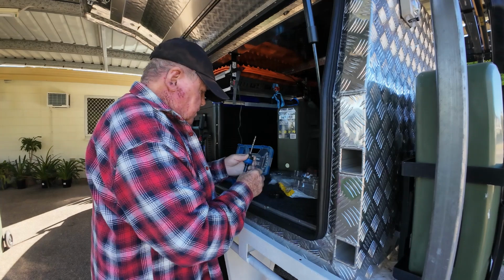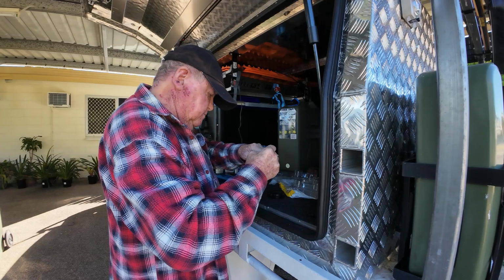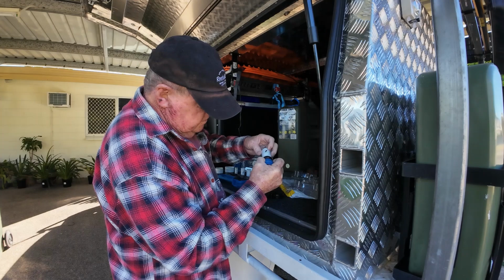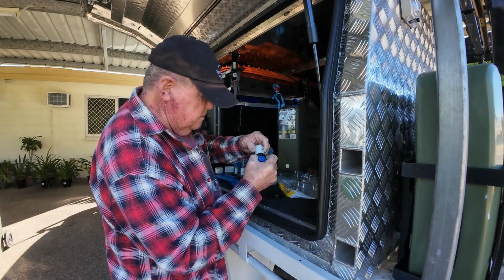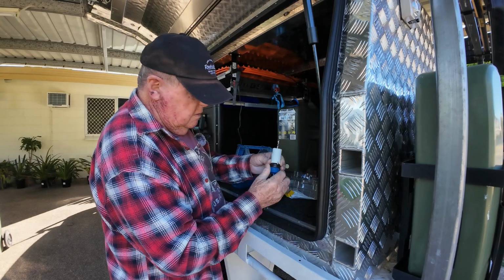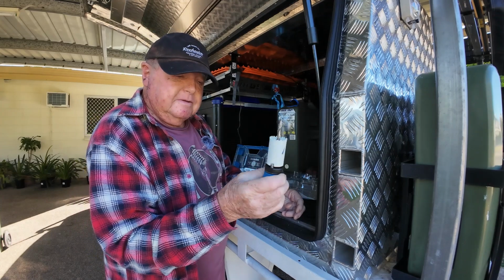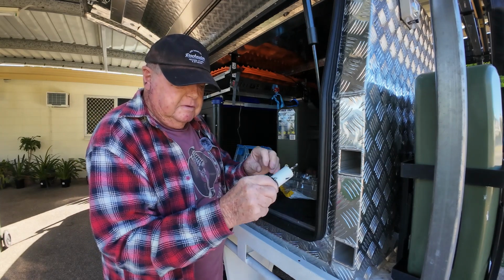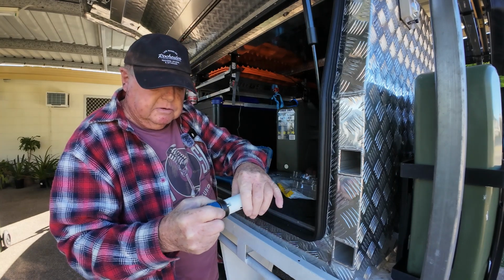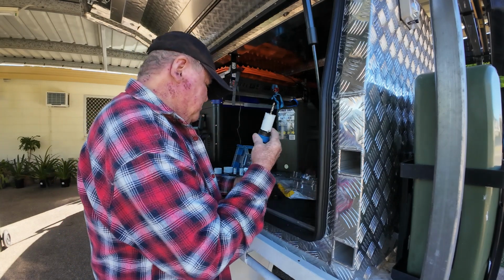Okay. Then you put on the hole saw, pull the collar back, screw it on in place. Don't fully put it down, and then the locking pins lock into there. If you don't do that, you can't get the thing undone. That locks it in place. So to release it, you pull this collar back here, and you can unscrew it. But if you don't do that, you'll never get it off. Well, you'll have to put it in a vise to get it off. It's a secret.